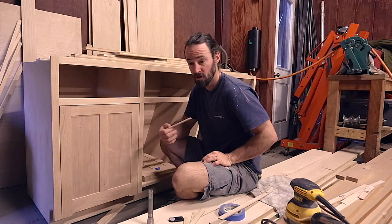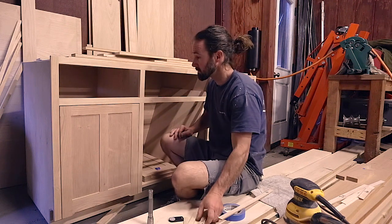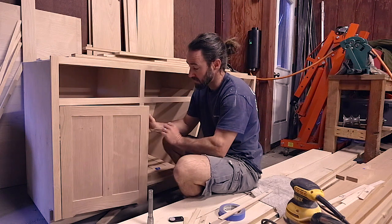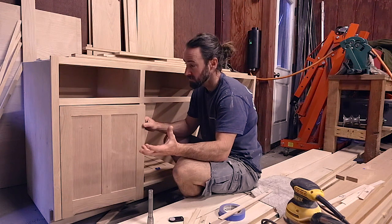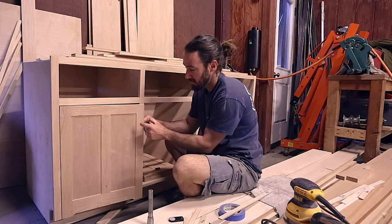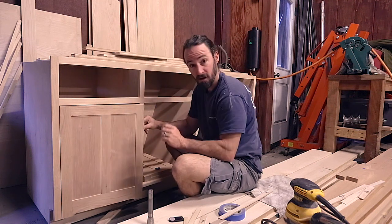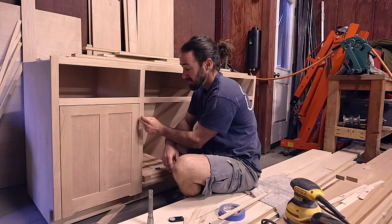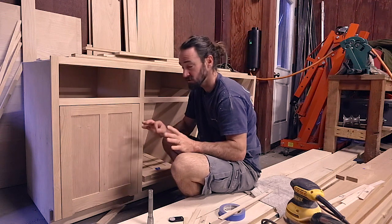I'll show you what I'm going to do when I trim up one of the door faces. First, let's talk about how I constructed the doors to account for this. I wanted the doors to have a 3/32 inch gap and I wanted to be able to remove some material to get that because it may not be perfectly square. So when I created the door and drawer faces — the stiles and the rails — I ripped them at 1/16 of an inch larger than needed, which encroaches on my gap and gives me extra space to remove.